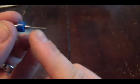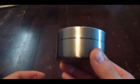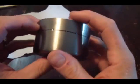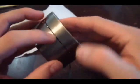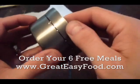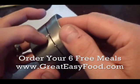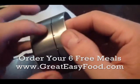This is about the same width as a needle, but this is probably too thick of aluminum to use a needle on, so you will want to use a drill bit. Okay, so I drilled out my little holes, which is where the flames will be coming out on this stove. With my Dremel tool, I drilled that out. You can see I messed up on a couple of them. That's okay. I still made sure the holes were good, and I might have just made the outside a little bit ugly. The stove will still work fine.